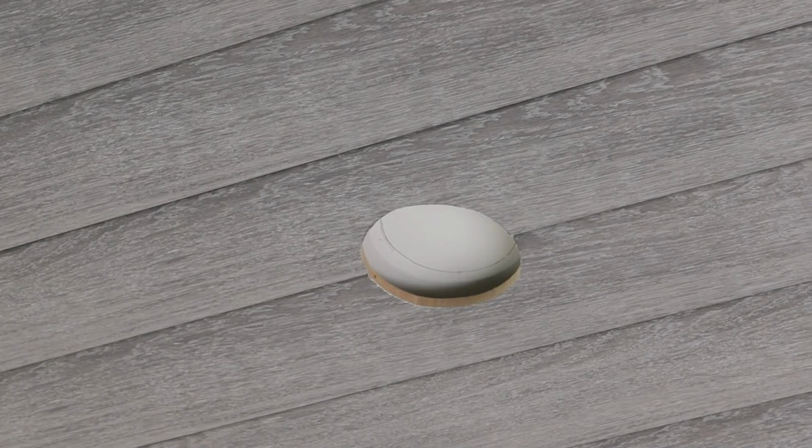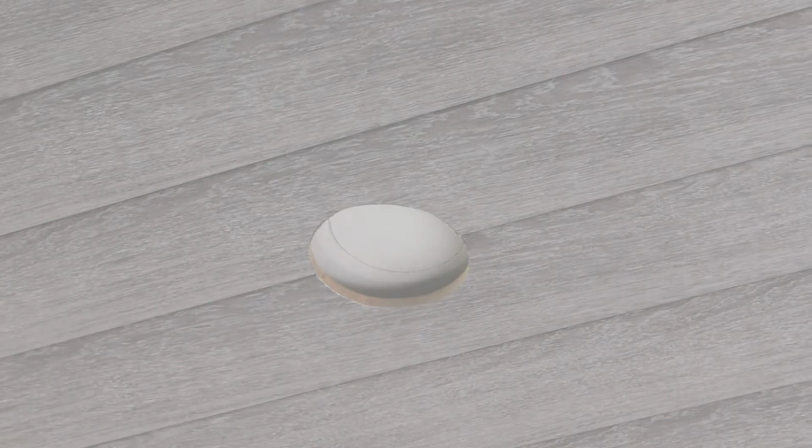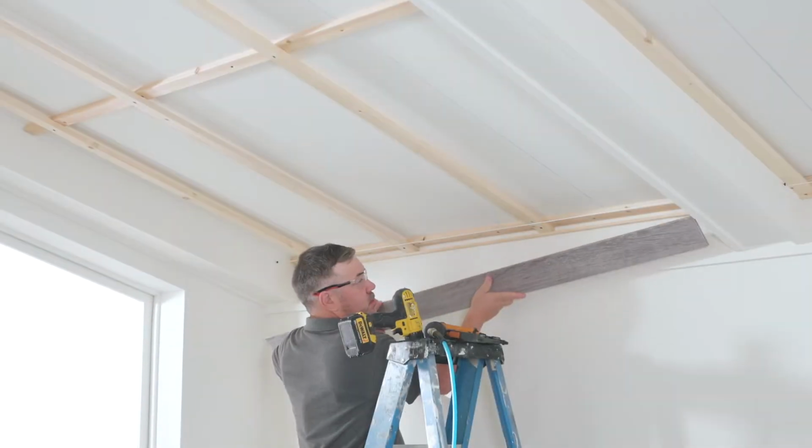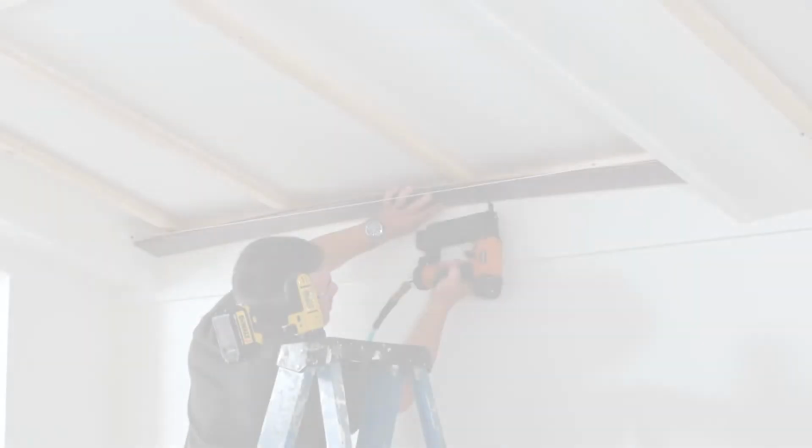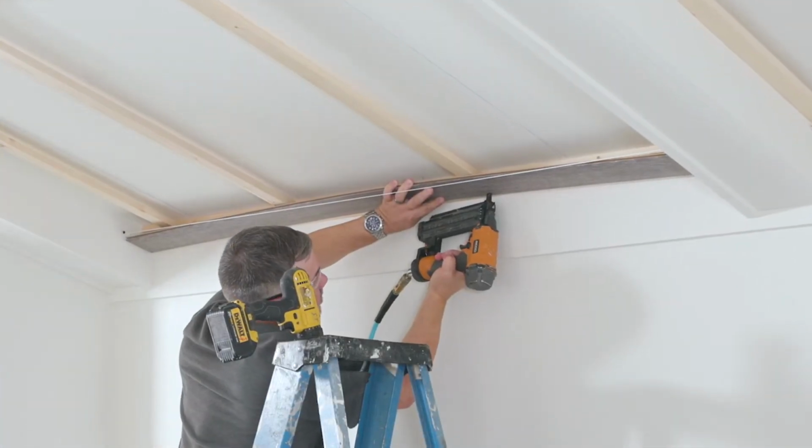The installation of the planks should start at the bottom. Remember to cut in all light fixtures and air returns as you install the planks. Lift the first plank into place and butt the cut tongue edge against the starter strip. A single screw or nail can be used to support the cut edge. It should be covered by a trim of your choice later in the installation.